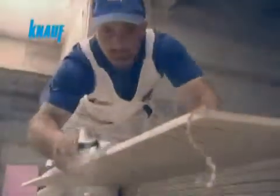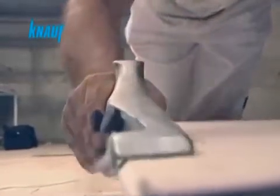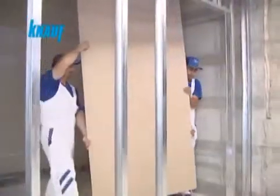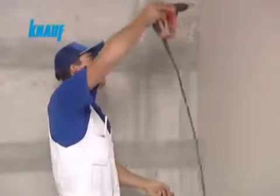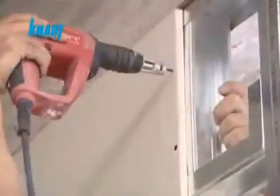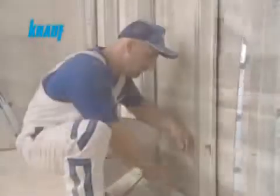Before installing the Knauf gypsum boards, the square edges should be trimmed with the help of a beveler to form artificial tapered edges. The Knauf gypsum boards should be carried upright from both ends with the longer edge parallel to the floor. The gypsum boards should be prepared approximately 1.5 centimeters shorter than the partition wall height and fixed vertically to the CW studs by using Knauf drywall screws with a maximum of 25 centimeters screw spacing. Continuous joints on the door framing ledges should be avoided by using a single piece of board on the corners.